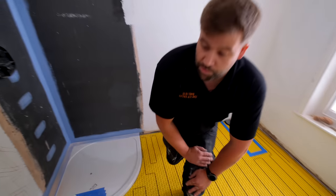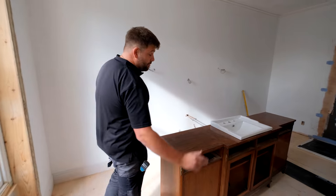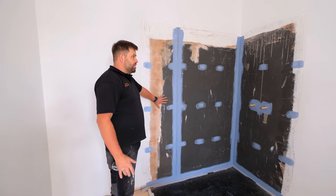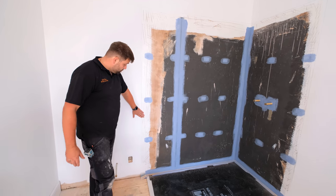And there's one more on the suite, which is the master, if you follow me through. And then this is the master ensuite. Obviously you've seen the room getting built with all the lads. Over to us now. Similar setup to the first bathroom that you came into. Using the 1200 by 600 tile again. It's a slightly different color. Same setup though, coming 100 mil past.